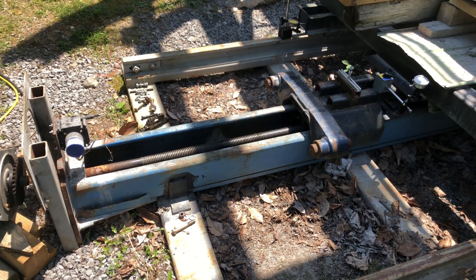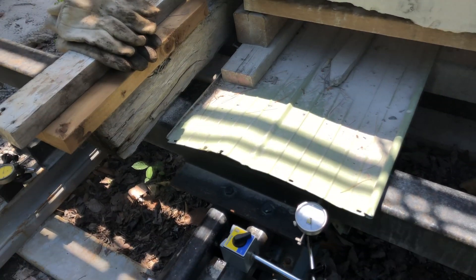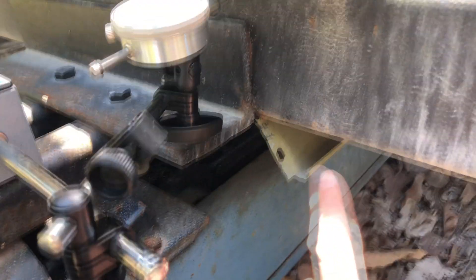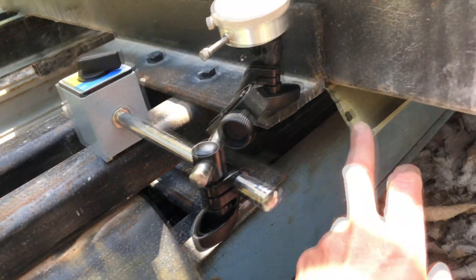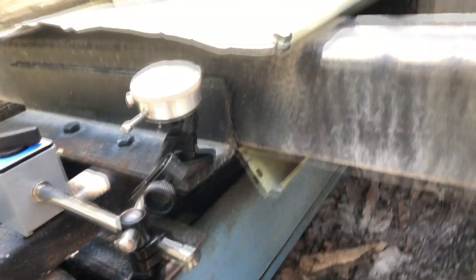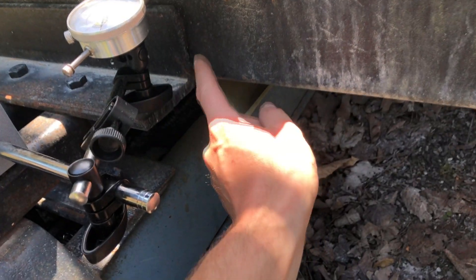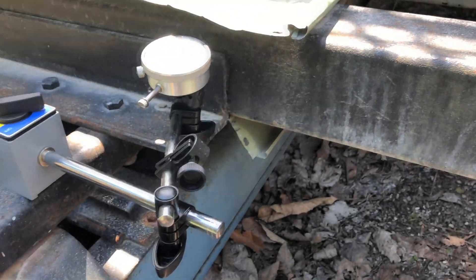I think I found the problem with my CNC setup and why the circles weren't drawing correctly — and it wasn't backlash, because I have linear encoders. What's happening is the way I originally designed this cart, I don't actually have it physically connected to the hoist part that moves. It's just sitting in between these two pieces of angle iron, with another one on the other side that it slots into, and then I have these bolts here. The idea was that if I wanted to move the cart without moving the hoist I could just undo two bolts and slide the whole cart backwards. The problem is because it's not welded or bolted to the hoist, the hoist moves but the cart doesn't.